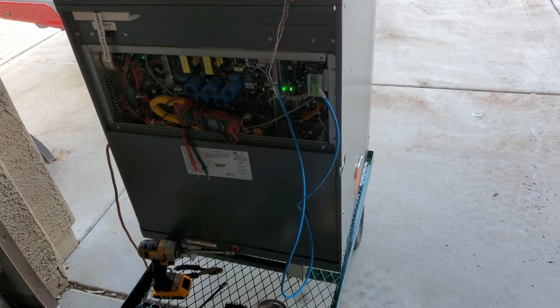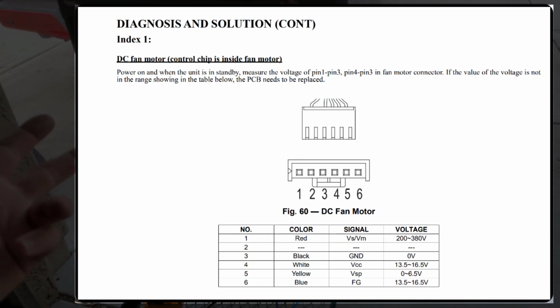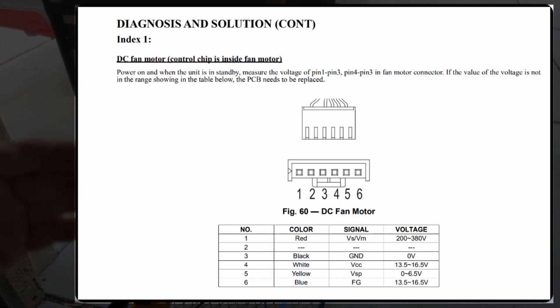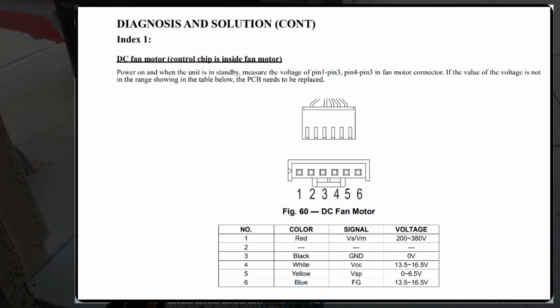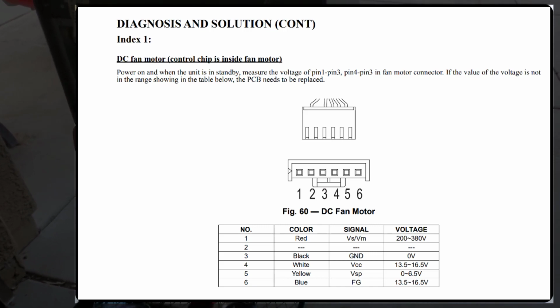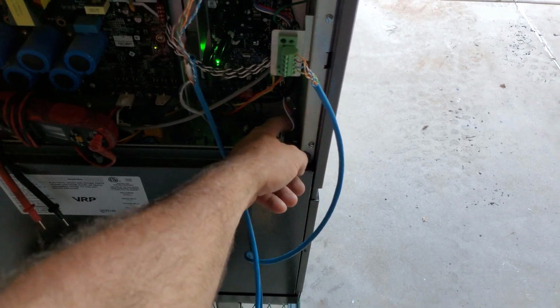A lot of the mini split blower motors usually have a DC bus going into them, and then you have approximately 15 volts to power the controls inside the motor, and then a 0 to 6 or whatever. It says to look for 0 to 6.5 volts. It could be a 0 to 5 or whatever signal, I don't know, but it has a variable DC pulse width modulation signal to tell it what speed to run. That'd be kind of cool if that's what this did, but